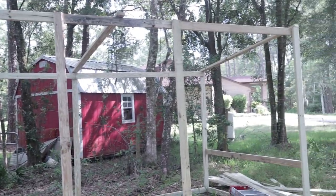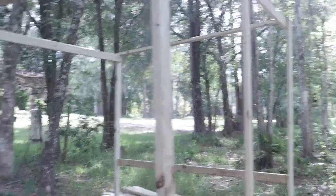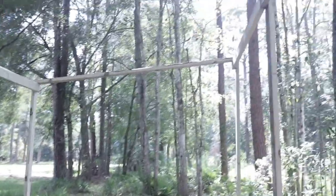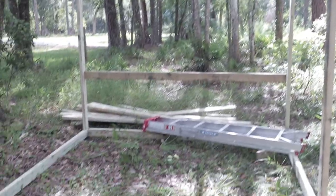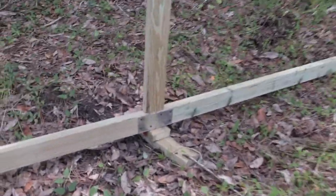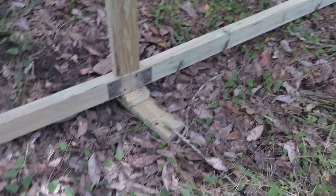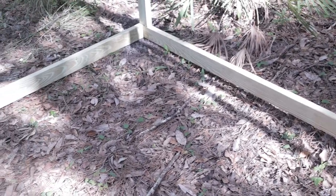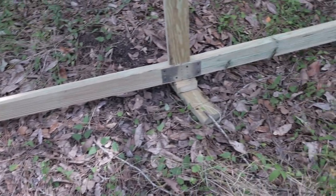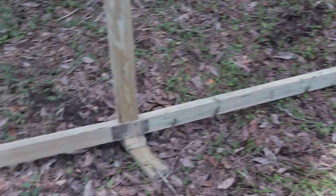Here's where we're at so far — really just a big square box. It leans back toward the rear of the coop, sloping downward. It's 16 feet by 8 feet: 7 feet tall on one end, 8 feet tall on the other corner. Our original plan was to use framing anchors but they were too flimsy for what we needed. We also didn't bother to fully level it since we'll add boards along the bottom afterward, and the whole thing will have mesh around it so there won't be any gaps. We used all two-by-fours and tried to cut as little as possible.